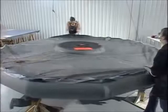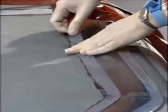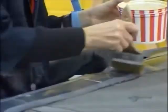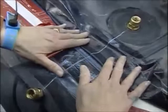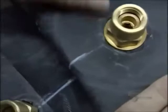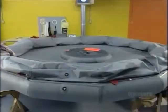They smooth down the edges to remove air bubbles. They run rubberized tape around the rim — it will protect it and also act as a hinge between the floor and the upper air chamber, which will go on next. In preparation for that, they measure to align all the inflation valves. Then they pull the upper air chamber — the walls of the raft — on top of the floor and lower chamber. They line up the valves but hold off on connecting them. Next, they pump regular air into the upper chamber to test the shape and function.